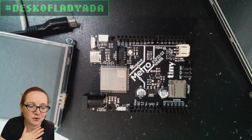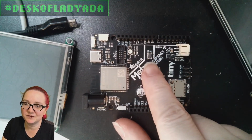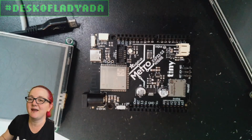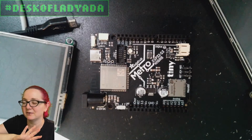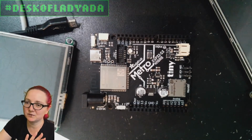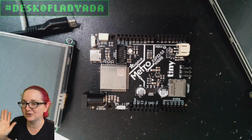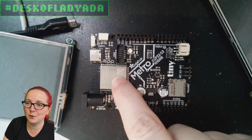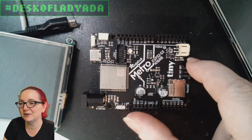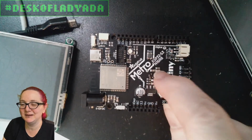Another thing I noticed is, unfortunately, I did a PR to update the pins for this in the Espressif board support package, but the next day they did a merge update with some ESP board support package 5.1 thing, and they ended up blowing away my changes. So I'm going to do another PR to fix the pins, because the old SPI pins are no longer used. They've been swapped out. Hopefully this Rev B is done.